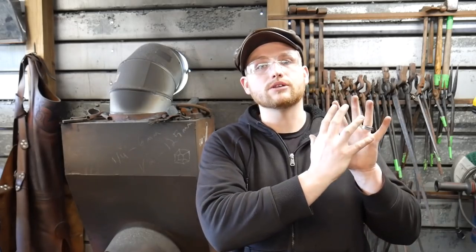Get yourself a good heat treating guide — a heat treat slide rule to identify what type of materials you are working with. If it's that critical, make sure you follow the rules for that particular tool steel. The last thing you want is to put a lot of effort into a piece, find out it was an oil hardening steel, quench it in water, and have the whole thing break on you in use. You get it too hard or too stressed and you lose all that work.